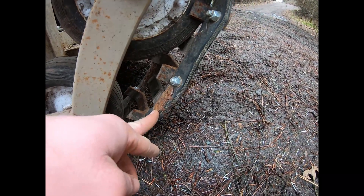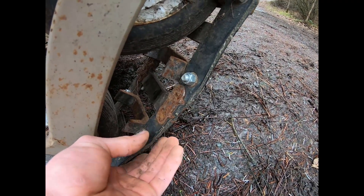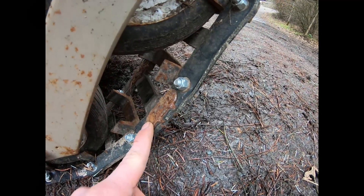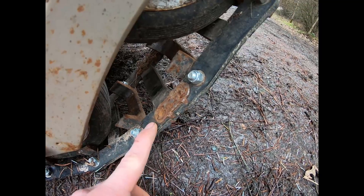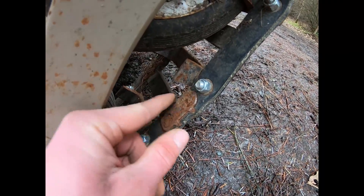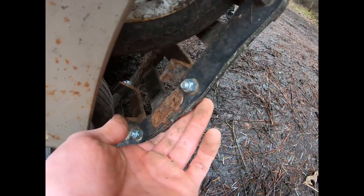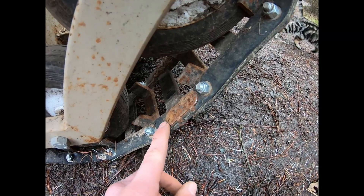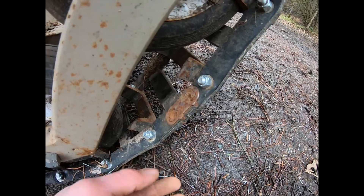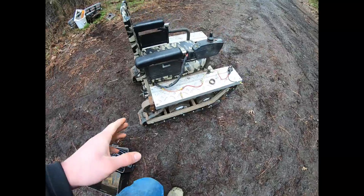The way I connected the track ends into one continuous loop was different from my full-size track vehicle. The guys who dropped off the rock-crusher conveyor belt from a quarry took interest in the project and gave me a bucket of clamps. These are used on the rock crushers themselves for repairs — they're exactly one inch wide with teeth, two-sided pieces that come with special locking screws, nuts, and a special tool. They fit my purpose perfectly. These aren't easy to come across, so a simple hinge would work just as well and allow a bit more flexibility.